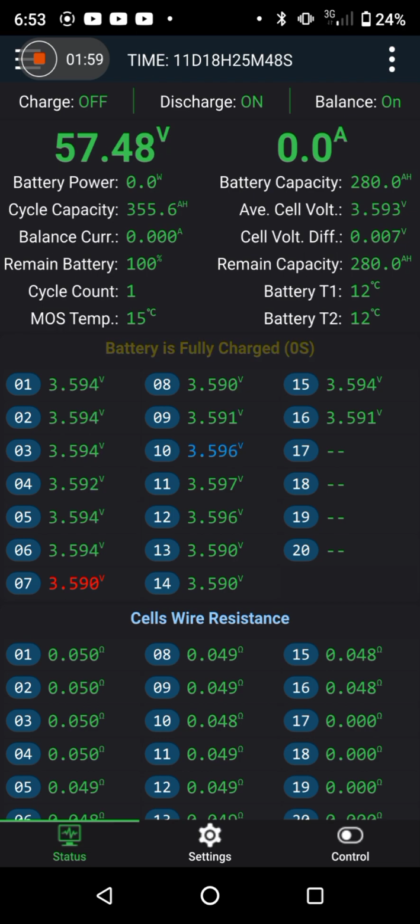So if I was just to be more patient with the big blue inverter, then I'm confident that it would have absorbed fully given time and reached a float voltage, but I haven't got the patience for that, and I've got a stack of washing to get on with. I'm going to need to tweak the recovery voltage, because I'm never going to reach the recovery voltage at this moment in time.